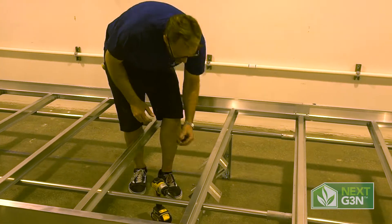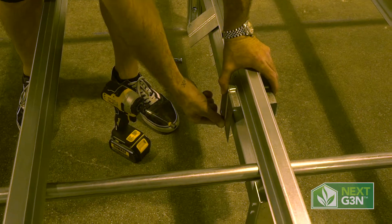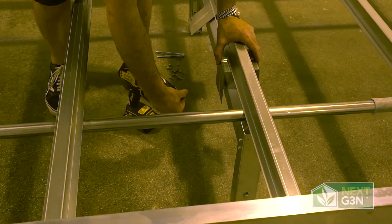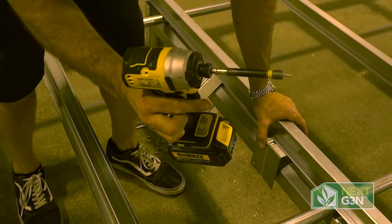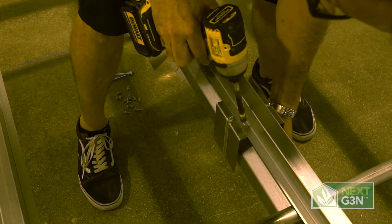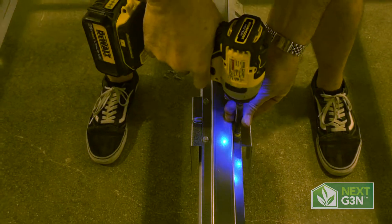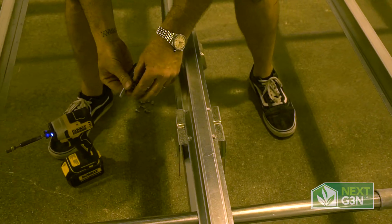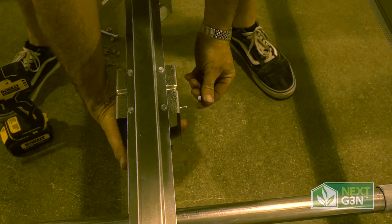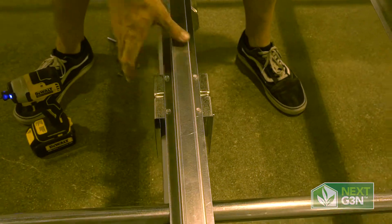What we're going to do is go ahead and install our anti-tip brackets. The anti-tip brackets are here so that when this is rolled all the way over, the bolt that goes through here will not allow the table to tip. We're going to use our standard sheet metal screw — every crossbar has holes pre-drilled, so I'm just going to line them up and install them. Once the bracket is installed on the crossbar, take a 5/16 bolt and standard nut, spread these through, squeeze it a little bit to preload it, and tighten the nut down. That'll stay like that and won't be an issue.